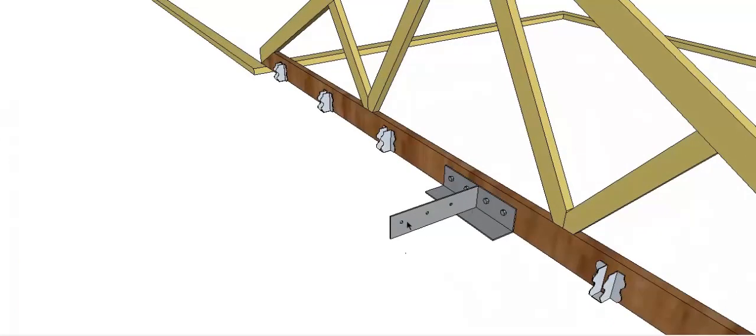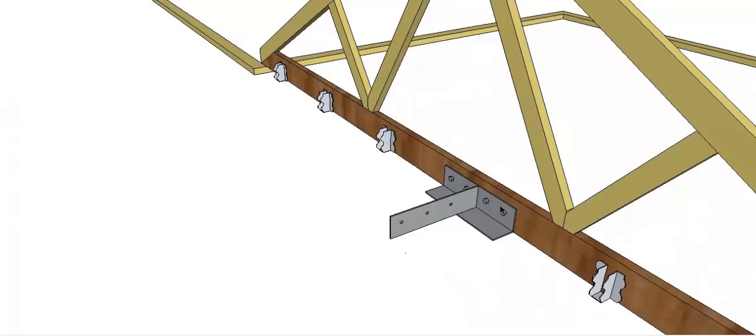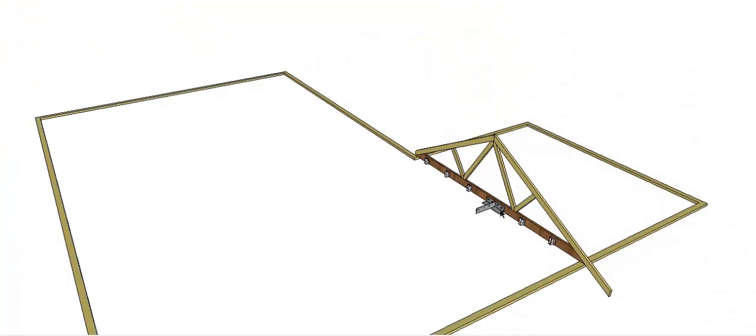These brackets can come pre-bolted to the truss or the holes could be drilled, depending on the manufacturer. Generally they don't bolt them on because they get in the road during transport, but they may have the holes there ready to go. So they put their high load bracket in, and that high load bracket will be the distance it needs to be from the end of the plate — that's called the first station. As I said, commonly it could be 2.4 or even 1800, depending on the size of the roof and the manufacturer.